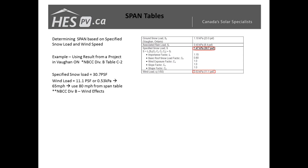That 11.1 PSF number doesn't mean a lot to most people — knowing miles per hour is more practical. So we have designed the span table with regards to miles per hour for wind. If you're trying to determine how to convert from PSF to miles per hour, the Div B wind effects section of your building code has a walkthrough on that. Other things to know about your roof include what it's made of, the slope, and where your trusses are.